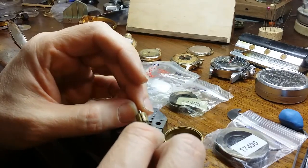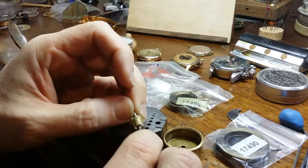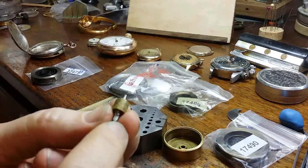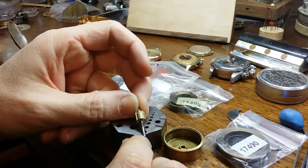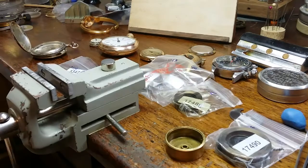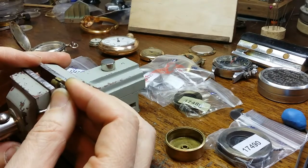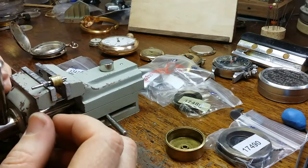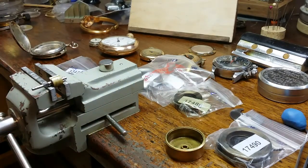When I took the old mainspring out of the barrel, the original barrel arbor had this notch filed in it where the mainspring was bent around and hooked onto it. But you can see here that originally there was indeed a hook on the barrel arbor as there typically is, and it is smashed down, worn down, and wasn't useful as a hook anymore. Right here I'm going to take a small chisel punch and try to raise the edge on the hook to make it useful again. Ultimately this effort will fail and I'll have to go a different route.